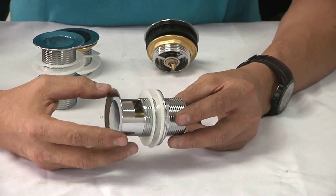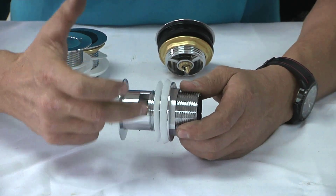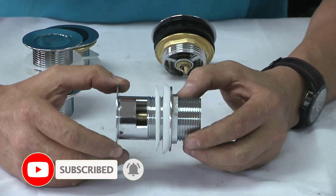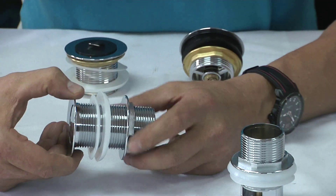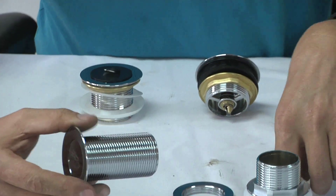In this tutorial we're discussing all about waste fittings — what a waste fitting is, how it's connected, and what it does. We have a 52 millimeter waste fitting where the thread is 32 millimeter. This waste fitting has a hole inside, which is used for a basin with an overflow. A 32mm waste fitting with a hole gets used on basins with overflows. Then we have a 32mm waste fitting without any holes, which is used on basins without overflows.